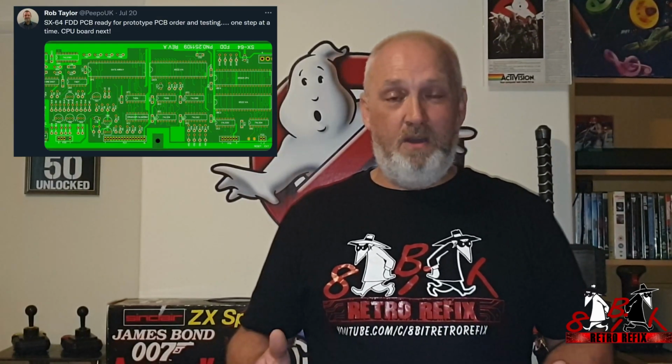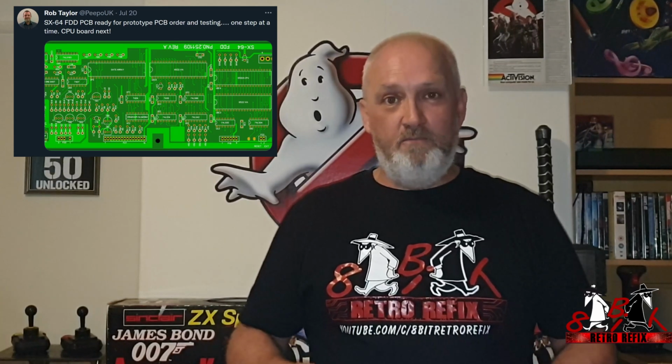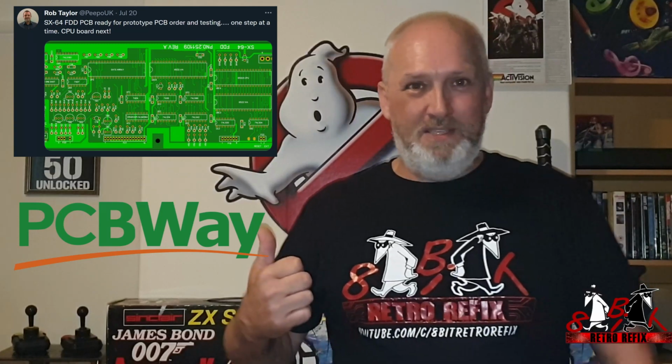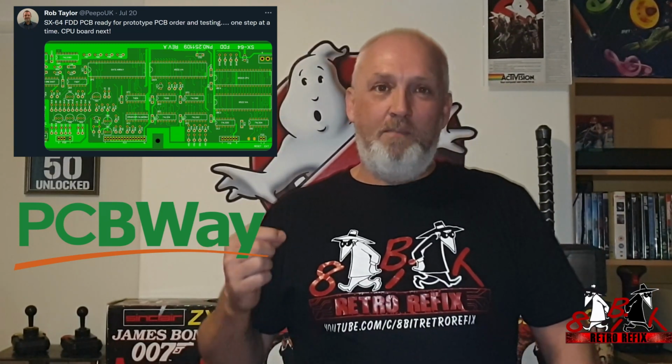That has parts missing. I believe that Rob Taylor, that makes the 64 clone boards, is now in the process of making the SX boards as well. I believe that he's not going to be putting them up for sale, but he's going to be allowing us to have the Gerber files for free, so we can send that to his partners at PCB Way and get them boards created. The SX that I've got, well, the two SXs that I've got now, they're both NTSC systems.